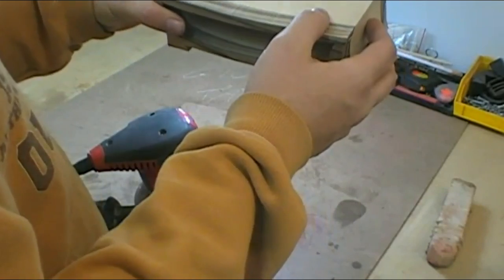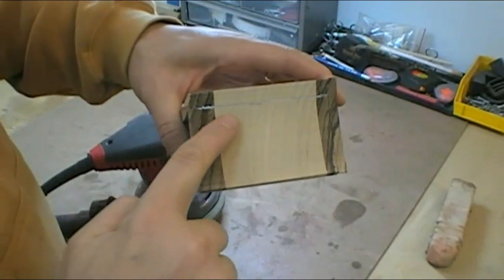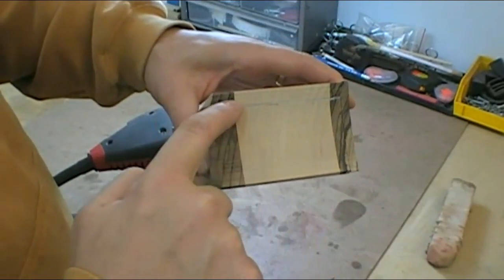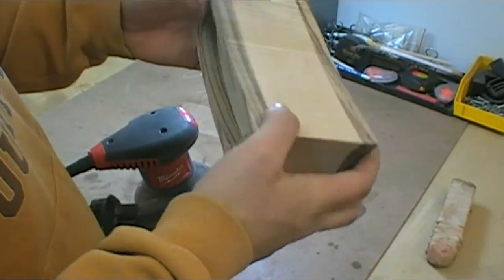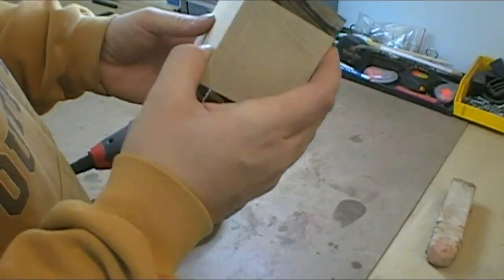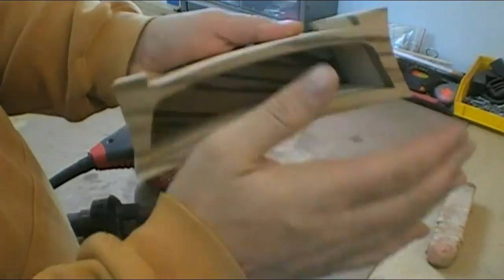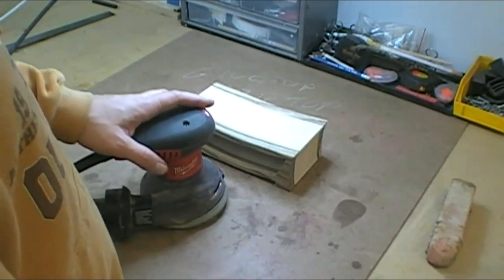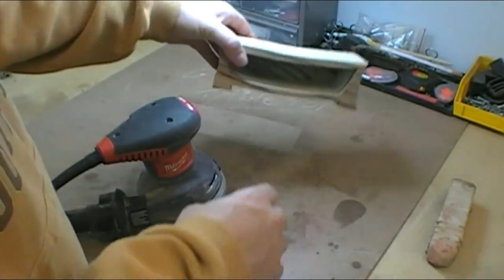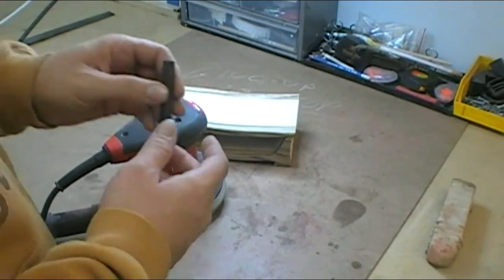So we'll get this all started. We're going to also try to just come in here really gently. You can see the glue line there from the accelerator on the cyanoacrylate glue, and then as far as other stuff maybe on the belt sander, I might hit the back a little bit here, and I might just touch up the front just a little bit here, and then get on to sanding a little bit of the drawer, not too much. I don't want to create that big gap like I talked about earlier. And then after that, I'm going to work on my drawer pull.